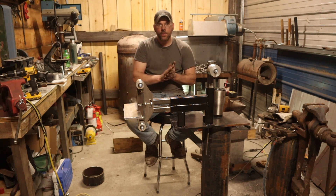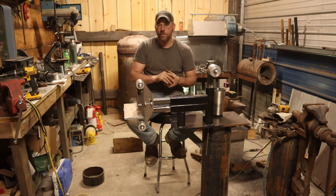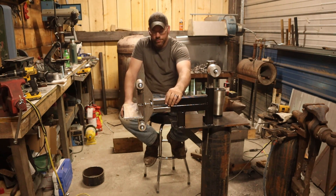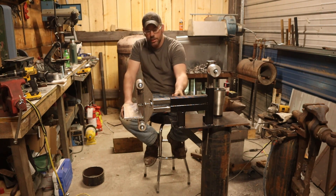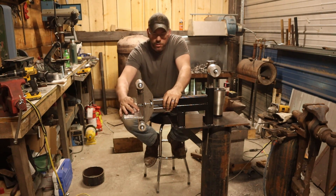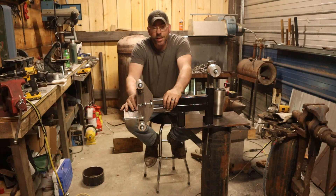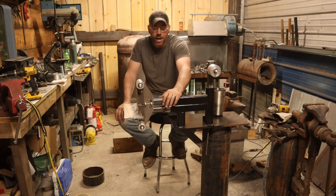All we have left: I need to order a couple of belts and get a hold of a motor. The frequency drive should be here Tuesday according to FedEx tracking. I'm super happy with where we are. I also brought the tool rest so it comes around the platen, because nothing I hate worse when I'm grinding is having a blade get sucked down in between the plate because you didn't have support on either side — and that's a real pain.